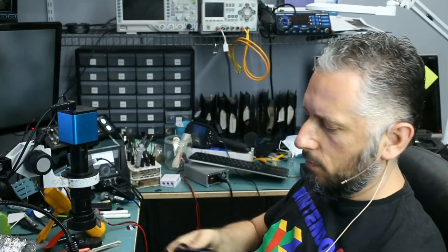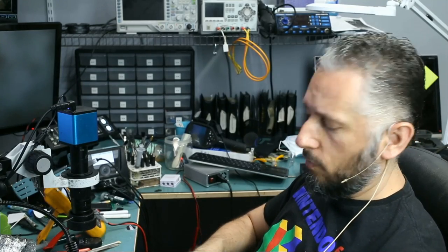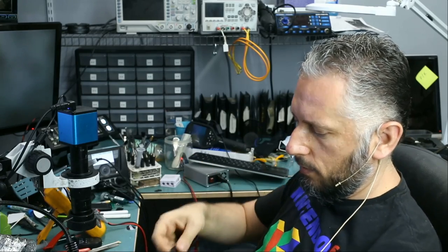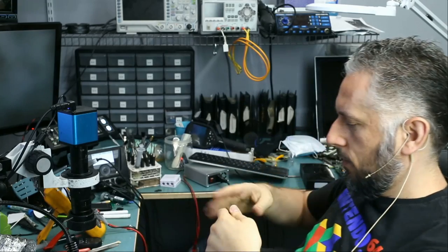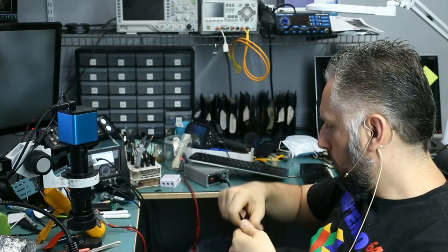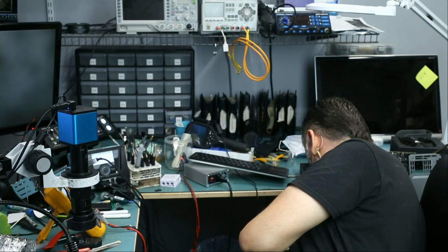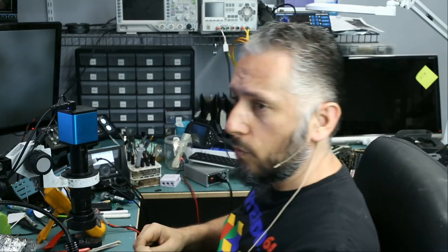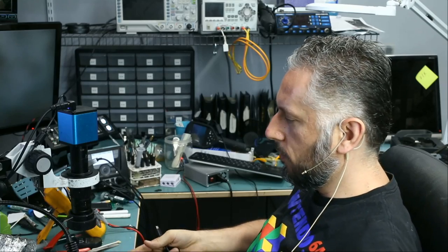Right, and I have the charger right here. Let's hope that what we did fixed the problem. Because even though we do this every day, it doesn't always turn out the way you want, and something else may be wrong. Right now, based on the physical inspection that we did and the chips that we replaced, we got rid of the diode short and we replaced both USB-C ICs. The laptop should work.